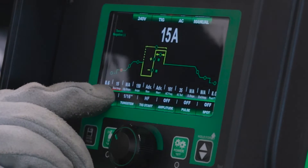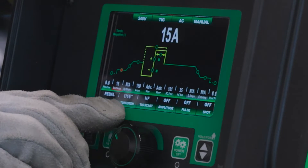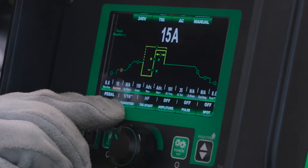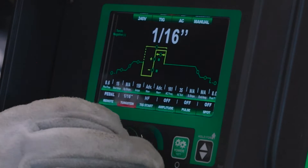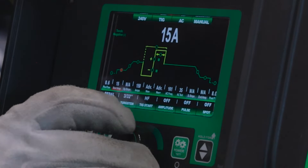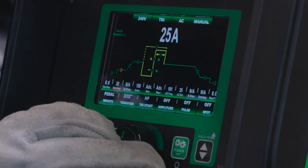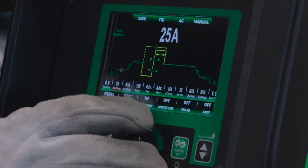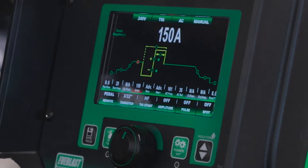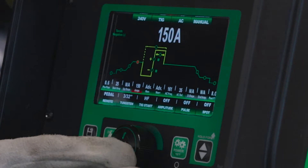One of the issues too — here we have a 15 start amp, and on our tungsten mode we're on 1/16th. We were actually running 3/32 tungsten. So we're going to turn that up to 3/32 and increase our start amps to 25, which is still lower than what I'd typically like. For 3/32 I'll go 35–40; for 1/8 inch, I'll go 50 to 60. But just to show this was a settings issue, we're still going to leave it a little lower than I'd typically like.